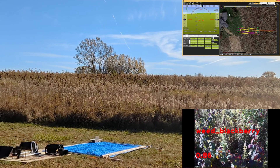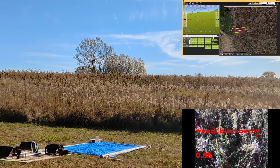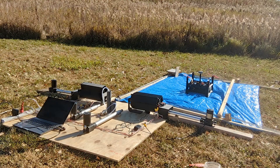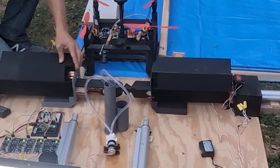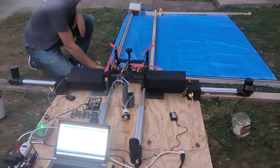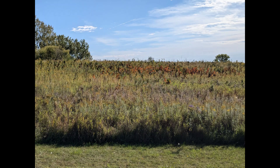Let's watch this for a couple more seconds and pick it up as it lands. When the drone completes its flight it returns to the landing pad and is gathered into a battery swap and refill bay. There are three battery bays on each side of the drone and whichever battery is fully charged is inserted into the drone while the old battery is ejected into a bay to recharge. Liquid from the reservoir is pumped to refill the drone, and finally the drone is pushed out of the swap bay onto the landing pad where it's loaded with a new flight plan and off it goes. That cycle repeats constantly. Here's a quick before-and-after photo: the blackberry plants are turning brown while the native grasses around them stay green.